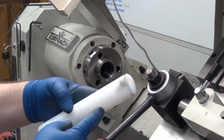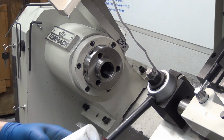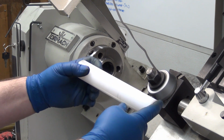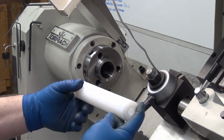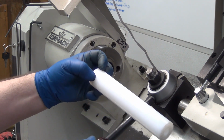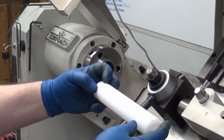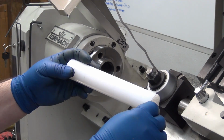And the reality is I could go put this on the manual lathe. Even the big piece, because I'm pretty sure it'll go through on my 13 by 40. I could skim off another 50 thousandths and see whether it goes through there. Thing is, a piece that long, processing that's long enough. Do I really want to add a whole other process on the manual lathe just to do this, when all I really have to do is bandsaw cut it down, and then I'll be able to take it down to this much stock. I'll waste a little bit more, but having 3 longer pieces to process as opposed to 4 shorter pieces means that I'm only going to have 3 pieces of waste instead of 4. And these are little, roughly 150 thou thick washers. I need about 200 of them.